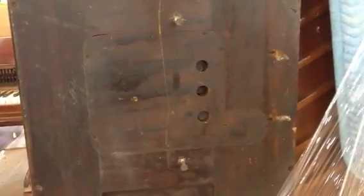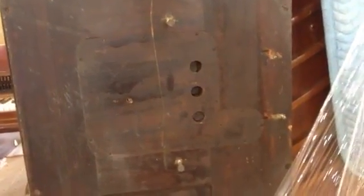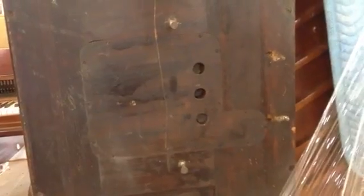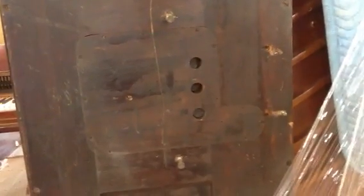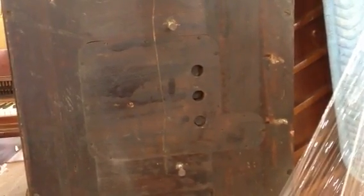I want to show you the underside of the piano. You can see there's kind of an outline inside the two-screw area — that is just a thin piece of wood which covers the pedal mechanism inside the piano. You can't connect anything through that area and expect good strength, so you have to connect it on the outside where you can see these pieces of wood. This side is hardwood and this side is softwood, so I have to have that full length spanning from one side to the other. That's why I needed to modify this lyre.